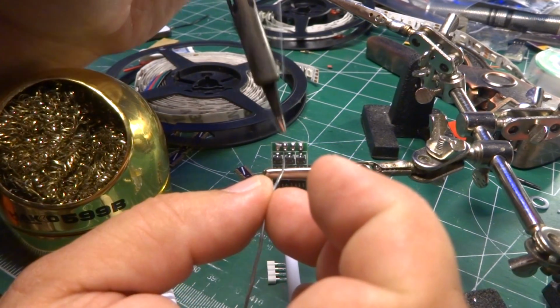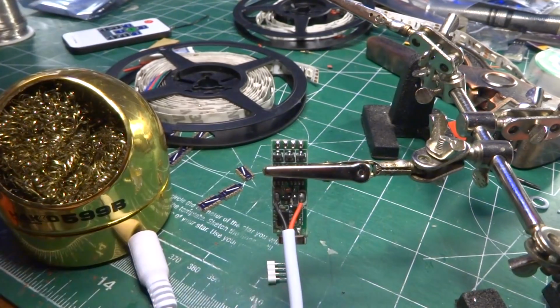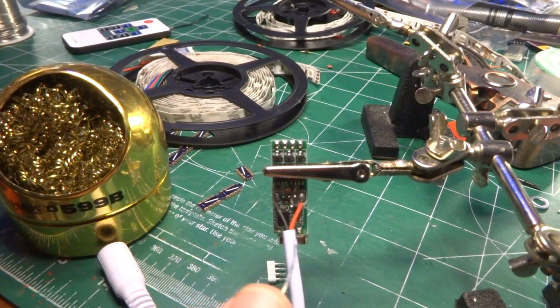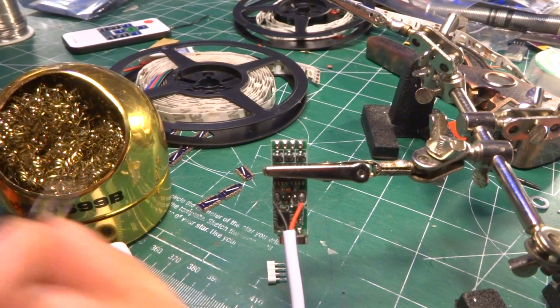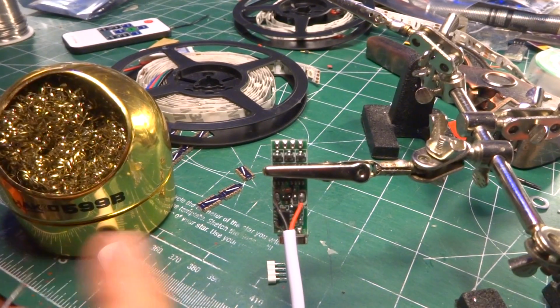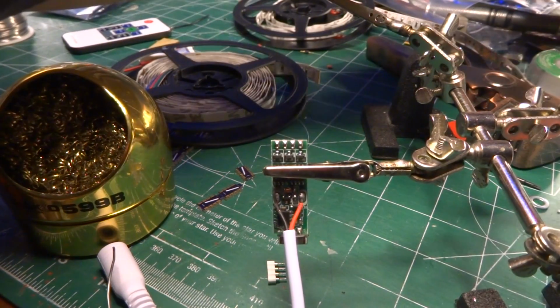And what I'm doing is I'm putting just a little dab of solder from here onto the iron itself, just to put a little bit more flux into the joint. That causes the solder to want to flow towards heat, and that guy is the hot spot. So now I've got this. Next trick is to wire it to something useful.